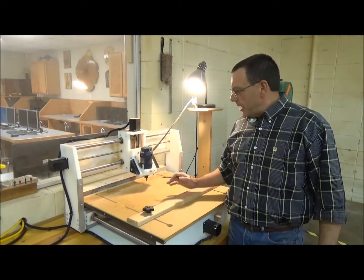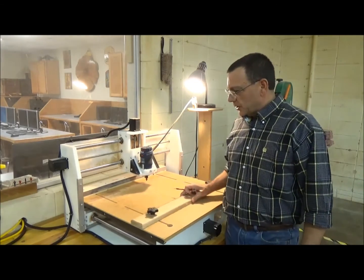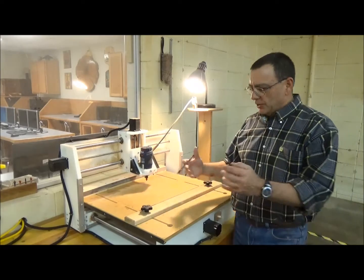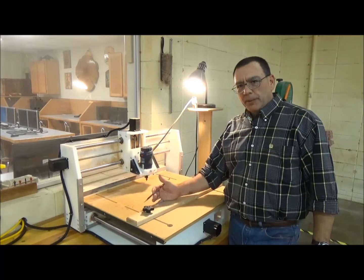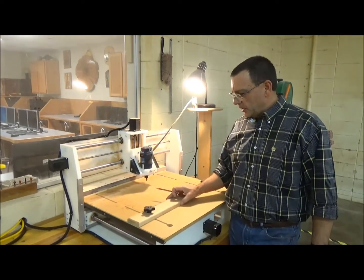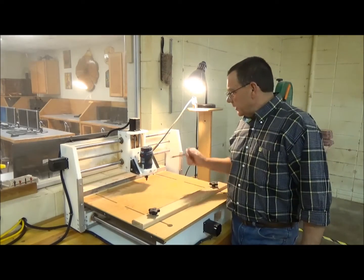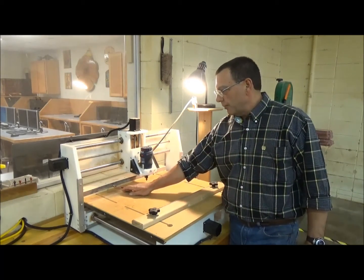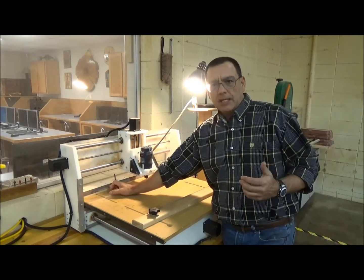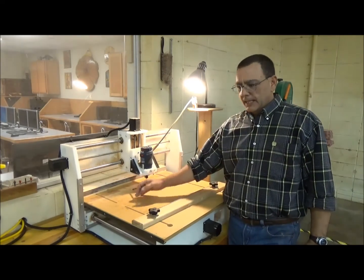A couple of things: I've modified my clamp for my CNC Shark carving machine. I've made a sliding vise so you can move it back and forth without doing the whole hold-down thing. With hold-downs, if something gets away it's more likely to hit your aluminum hold-downs. This setup is sacrificial — it's made out of wood, so the only real problem would be hitting that metal fastener. I also fixed a strip across the back and use thick double-face tape with a tacky yet rigid surface to keep things from moving.